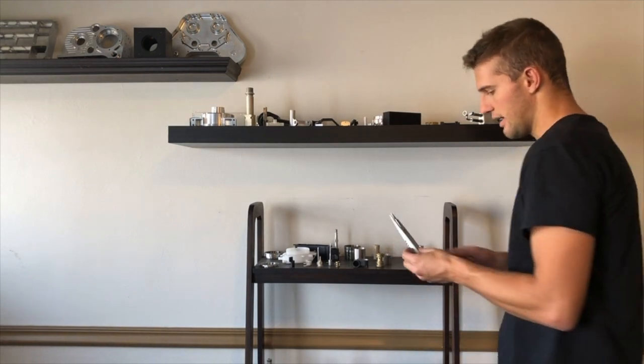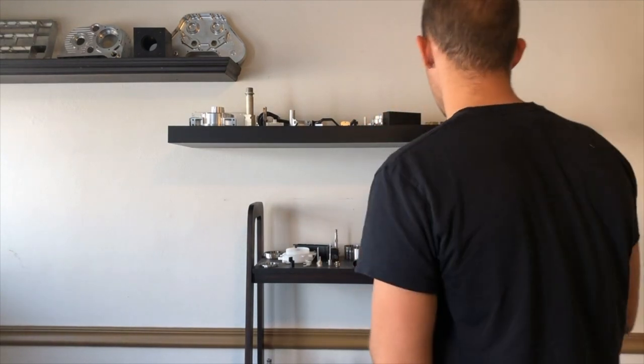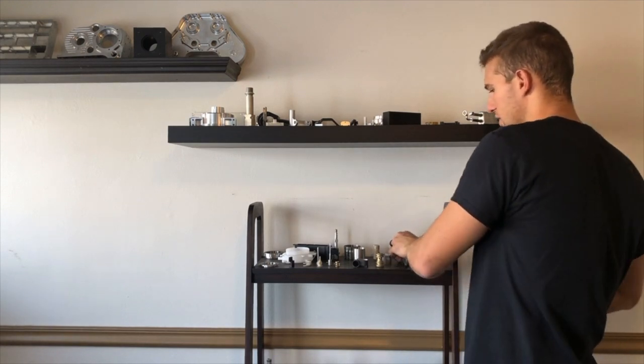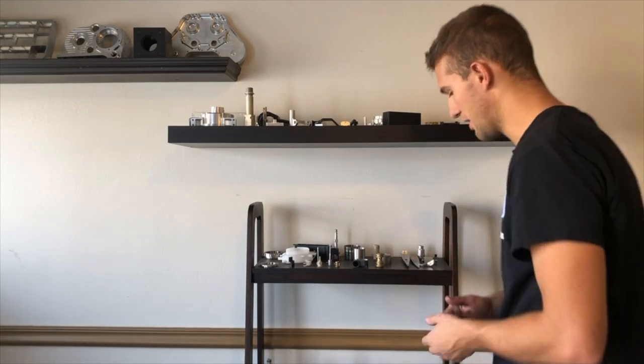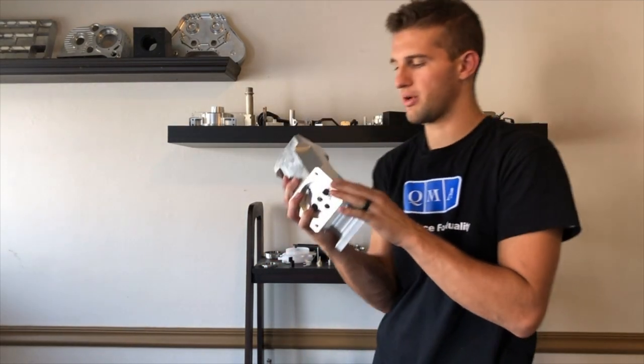You've got that thin-walled part — we actually 3D milled that on the Makino horizontal. The first question you ask yourself as a machinist is: how am I going to hold that part? You can kind of see the surface finish on it — it's good. But it's a really thin-walled part, so you've got to come up with different jaws and different fixture rings to be able to hold something like that. But really, we're pretty diverse. We can do a lot of types of parts — smaller parts to medium-sized parts. And this is some of the bigger parts we've done in the past.